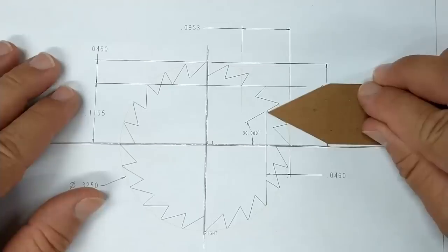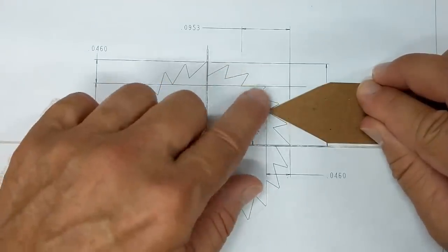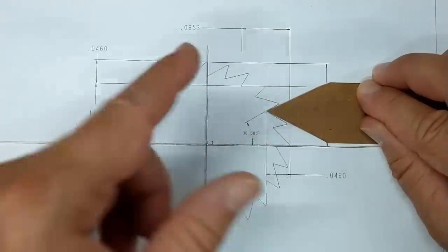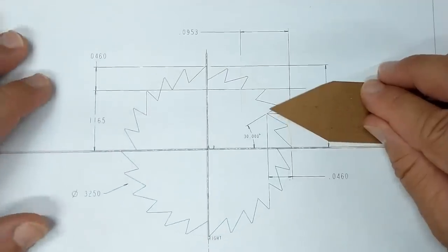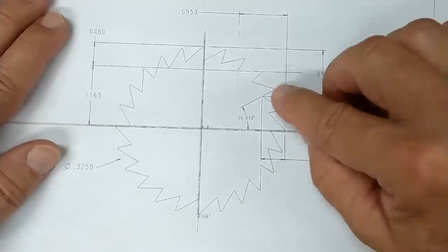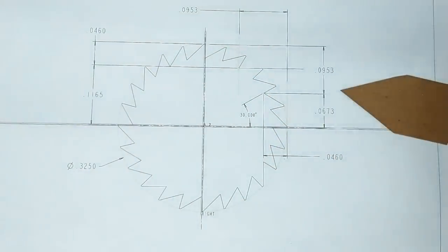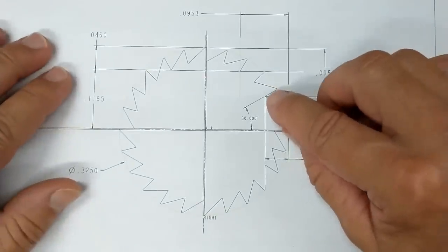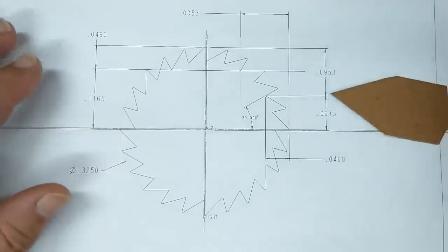You can see how that's going to be quite effective to cut the gears as well. I'm going to form a flat and a 60-degree angle, but I'm going to form it at a 30-and-30 projection accordingly, and just index the part every time I want to make another cut. It's going to be real fragile all the way around the edge. If the tool is not sharp, if it's dragging, if there's any back contact on your tool, these teeth are going to look absolutely no bueno — horrible.